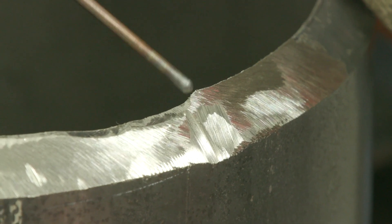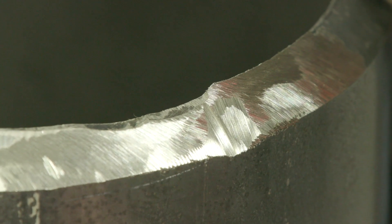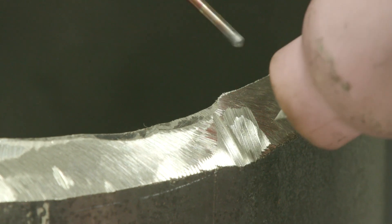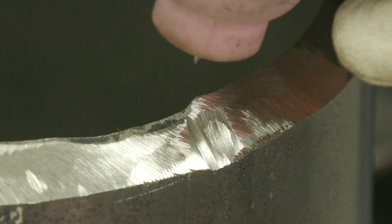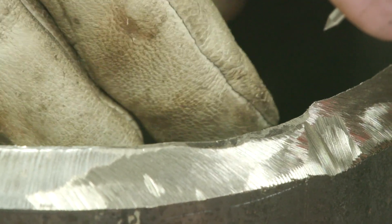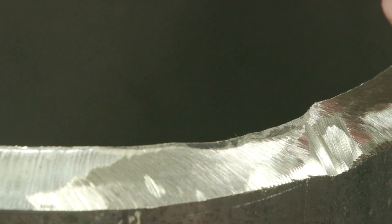I have this area prepped. I cleaned out where the start and stop was on the plasma cut, which created a depression, and then I flat-grinded the bevel. I still have this enormous ding in here that was created when it got bumped too hard, so I'm going to first fill this crater in, then go across this bevel top edge where it's collapsed and cratered, build it up, clean the inside, and bring it back to the original diameter dimension. I buff this off and flatten it back with the original bevel angle and I should be done.